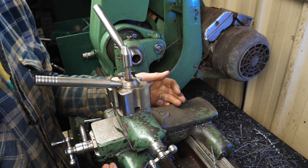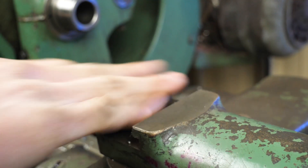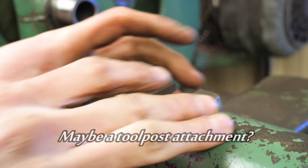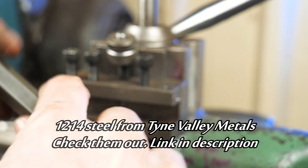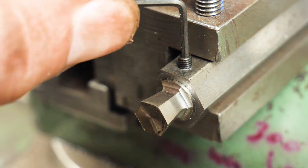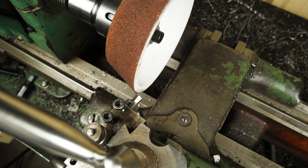Depending on your lathe, indexing the tool could actually be quite easy. My lathe has a curved surface here, but some lathes have a boring table where you can clamp the tool down in a collet block and index it. You could also use the top of your compound and find a way to bolt a collet block down there. I'm not going to do any of that though — I'm going to go back to a normal tool post. To index my tool, I've got this 1214 hex stock with a 10mm reamed hole and a set screw. This fits nicely in my tool post. For this process, I think we'll use the cross slide, and we need to kick the tool off at the desired angle.